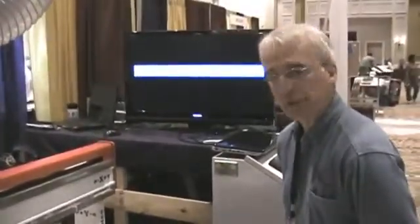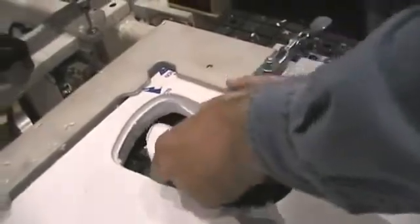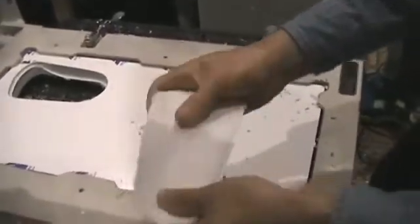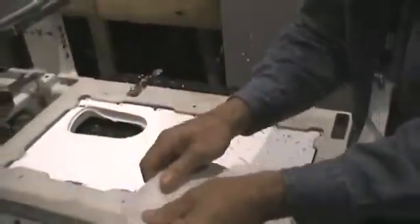That's a finished program. As you can see, we've finished the bottom side of our orthotic that we designed — we've got some nice little tabs left there. We can just pop this part right out of the material. This is an arch support now that's ready to be finished. A little bit of touch-up finishing on the edge. We use a coarser finish on the top because the material and adhesive sticks better to the top surface with a coarser finish.